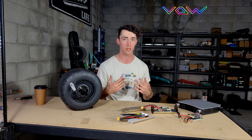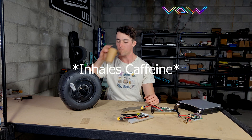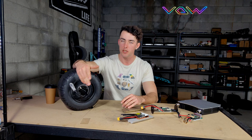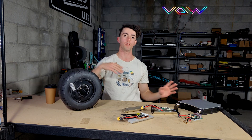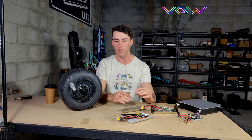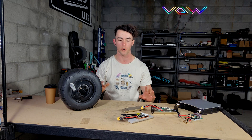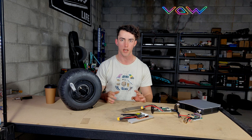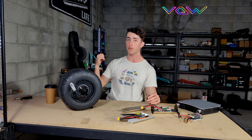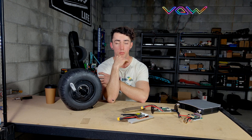On top of all of that, I didn't know if any of this was going to work at all. Of course, I've been riding it for the last two days, so it's great. The problem was I didn't know whether or not the controller would work at all with all of the magnetic fields running around the motor — there shouldn't be too much magnetic flux leakage into the axle, but I had no idea whether it would mess up the microcontrollers. Thankfully not the case. I was worried about the Bluetooth connection not connecting to the board at all, just due to the interference from being inside the axle — all of those magnets, all of those electromagnets would kill any Bluetooth connection. Also luckily, no idea why, not the case at all. I've gone out for huge rides on this board already and had a perfect Bluetooth connection the whole time.